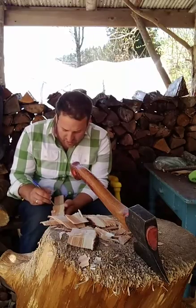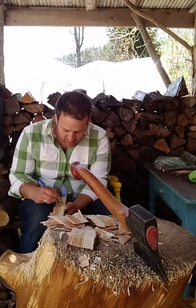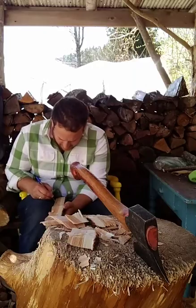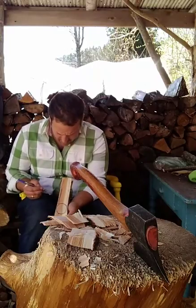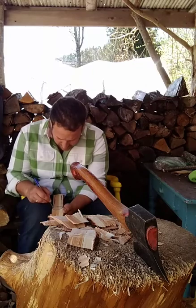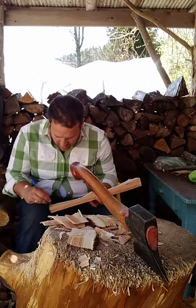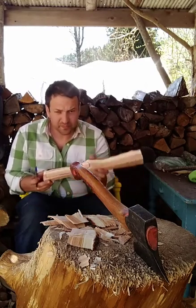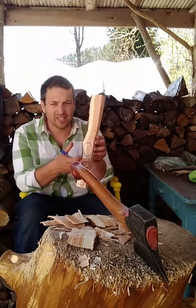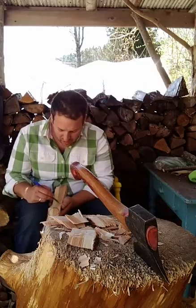Now, when you don't have those shoulders, when the neck is as wide as the bowl, I've actually found it makes carving a sweet curve to the inside of the bowl extremely tricky. So even though in many ways this style of spoon is simpler to carve than other spoons because there's no neck on the outside, in terms of being able to visualize what works and what doesn't work on them, they can actually be trickier. Because when you're carving this, you don't have the shoulder on the outside to then match the inside curve to. You just have to be able to see it, or see it well enough to draw it with your pencil again.